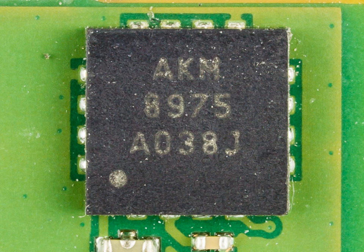Magnetic field sensing: magnetometers can be categorized into four general types depending on the magnitude of the measured field. If the targeted B field is larger than the Earth's magnetic field, with a maximum value around 60 µT, the sensor does not need to be very sensitive. To measure the Earth field larger than the geomagnetic noise around 0.1 nT, better sensors are required.